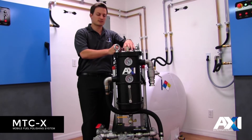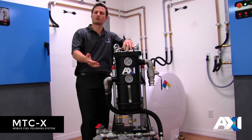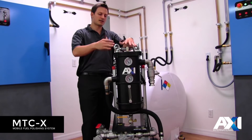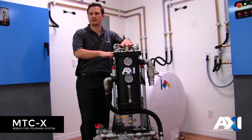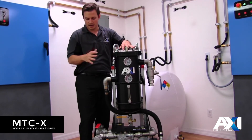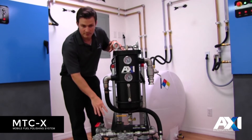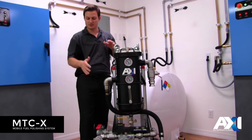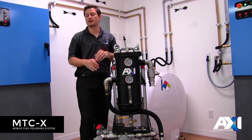Check the filter every 20 to 30 minutes. When it stops clogging, move to a smaller micron filter in the pre-filter vessel. Keep stepping down — basically when you get down to around 10 micron or 1 micron, you'll be at a point where you're ready to switch into fine filtration mode. Leave the same bag in place as long as you're not getting a high differential reading, and you're ready to move into phase three.